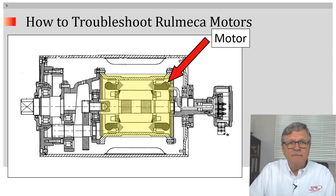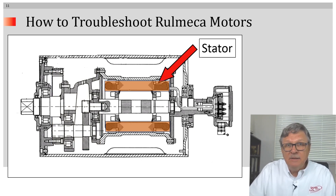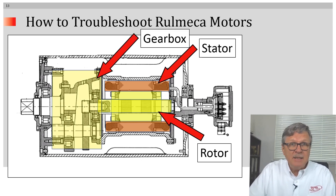We have the motor directly coupled to either a two-stage or a three-stage gearbox. The motor consists of a stationary stator and a rotor which rotates on two bearings mounted in each of the two sides of the motor frame. The motor is directly coupled to a gearbox — these are the essential drivetrain units to turn the pulley shell.